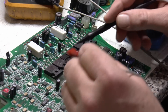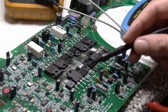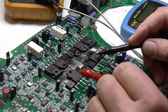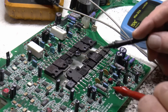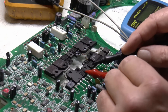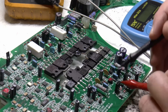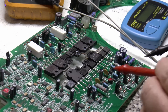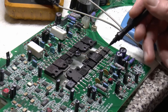In the middle, this pot sets the trim and the bias - it's sealed, so don't adjust it unless you're going to set the amp bias. This side has the thermistor. These are high-power transistors - this side is PNP on the minus 45-volt rail, and the other side is NPN on the plus 45-volt rail. These two transistors at the end run on plus and minus 15 volts.